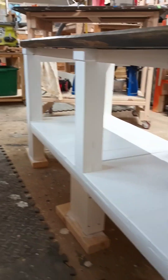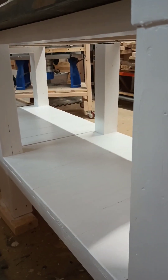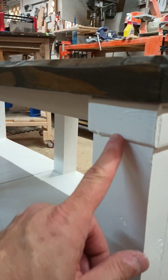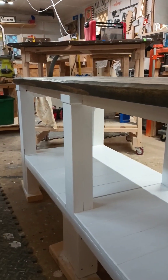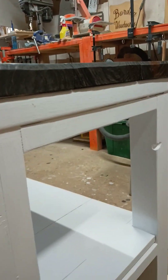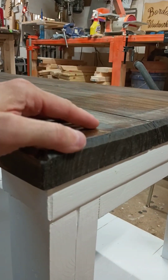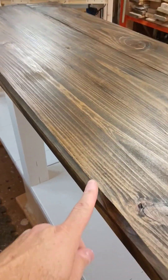It's got two coats of paint on it right now. I made these little trim pieces at the top on each one of the columns to give it a little decorative look, going down the sides of the ends to cover up where the two boards met. On the top, I used a round-over bit on my router and went all the way around it to make a smooth cut.